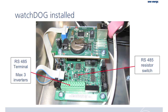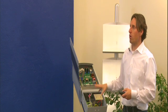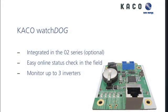This is a picture of an installed Watchdog card. You can see the base card has a little switch and termination for the RS-485, labeled A and B. The Watchdog card supports up to three inverters but can be used as a single, two, or three inverter setup. The Watchdog can hold data for only a day and a half, so if you lose internet you need to restore the connection within that window.